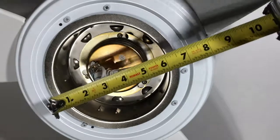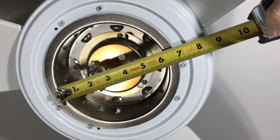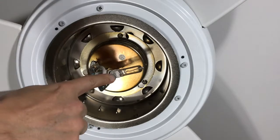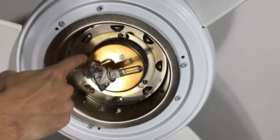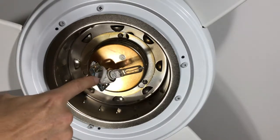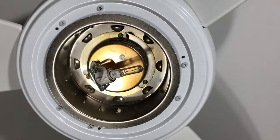The opening is six inches in diameter, so the LED module needs to be about five and a half inches or smaller. This light bulb uses 110 volts, so the LED module needs to match that. This plate here holds the light bulb and is itself held in place with three screws. I'll remove it and modify it to hold the LED instead.